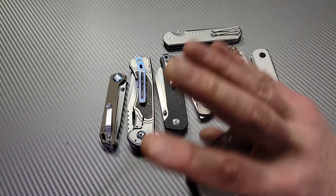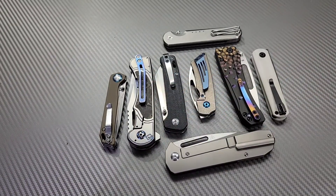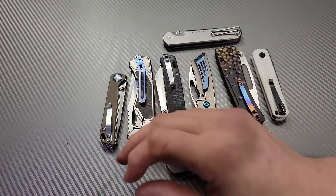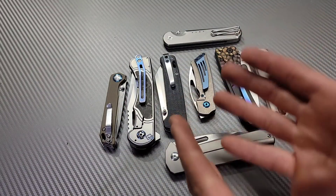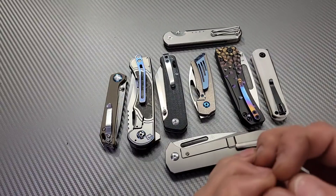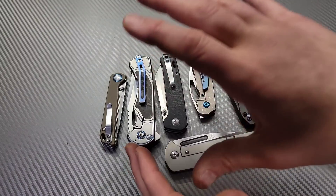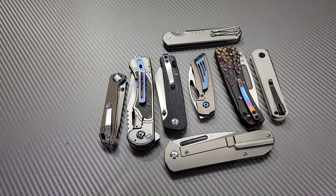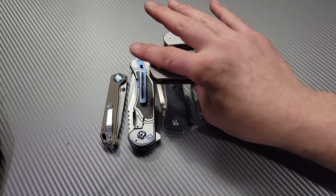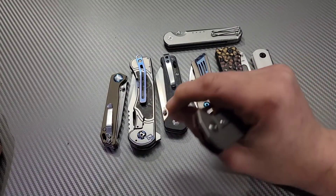When we get knives, most of the time they have a burnt edge. It's just the way it is, and you can watch cut tests that prove this over and over again — factory edges are not as good quality as a sharpened edge done at home, by a system, or freehand. The belts that finish the sharpen on knives from factories give a lot of them burnt edges. So some of us want to remove steel right away and get to some good quality steel.